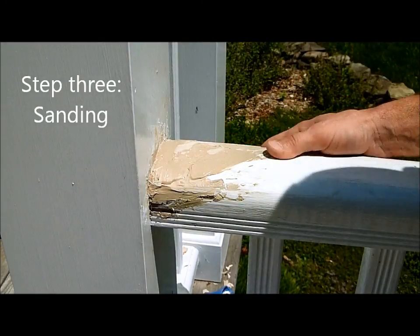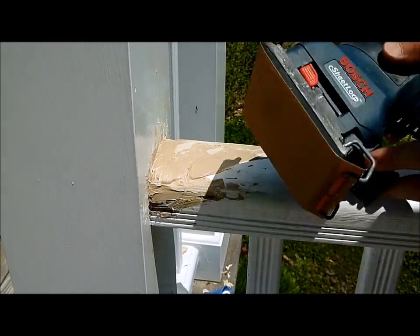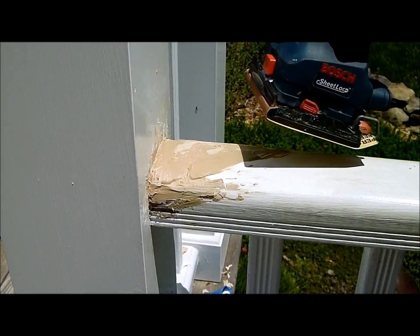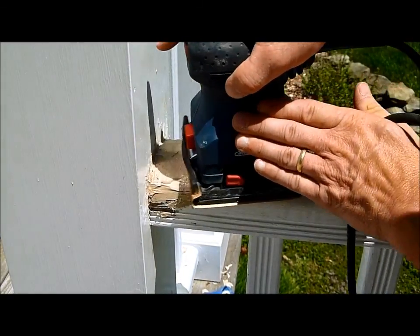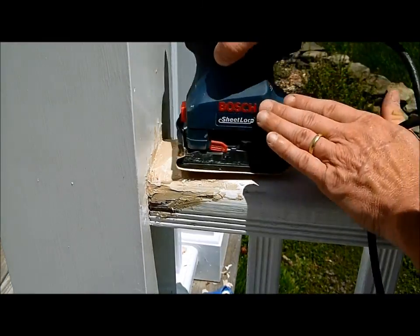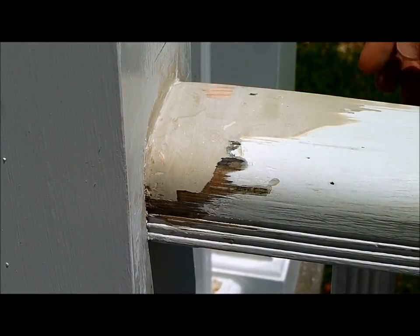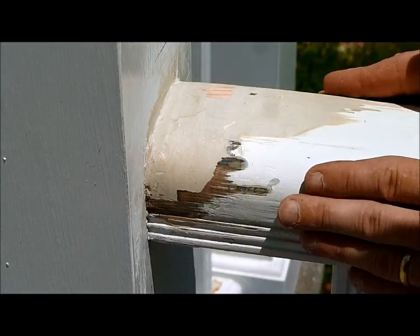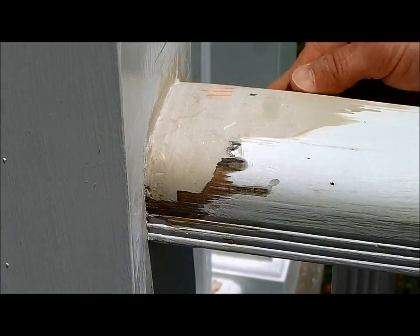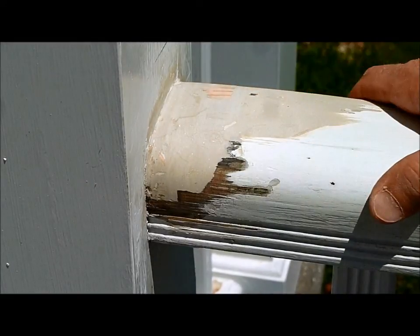After a third coat of the wood filler it's starting to set up but still a little tacky and soft, so I'm going to take a machine sander and roughly carve out where we are and see how much more I'll need. After sanding with the machine sander we're actually pretty good — I don't think I need any more filler. It's roughly smooth and in line with the existing wood. Now I just want to take some sandpaper and maybe chisels to clean up these edges by hand and make sure the plane of the new repair fits in with the existing wood.